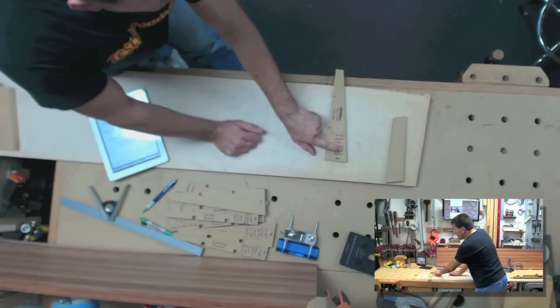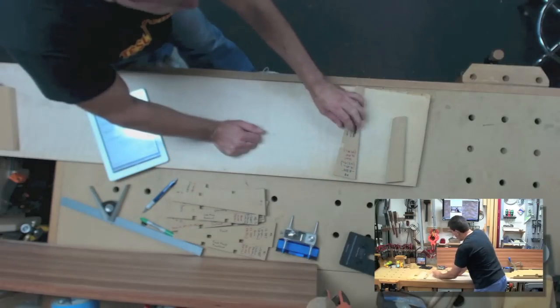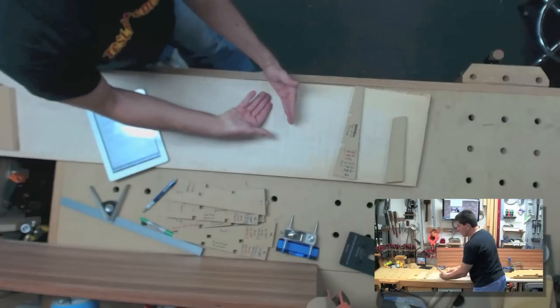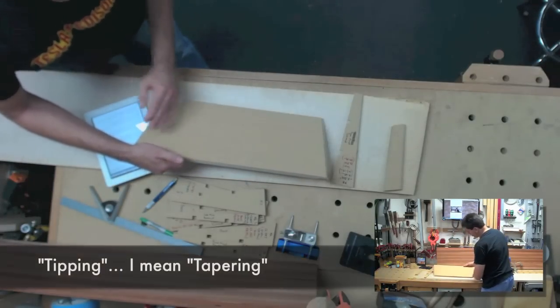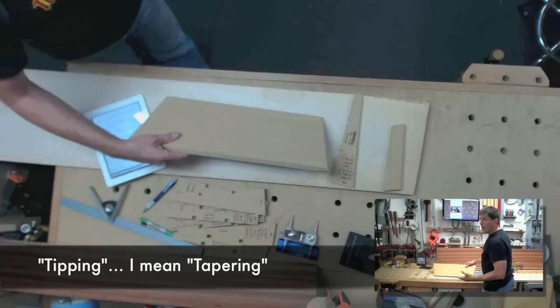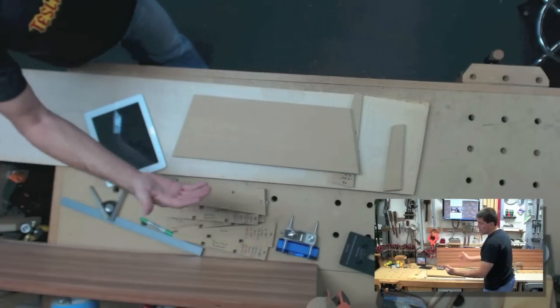I have a really big negative sign on it to make sure I remember that. What it is, all positive angles come into a bore. In my program, at least, a positive angle is one where it's tipping down into the stock. So this is like the normal angle that you would have if you were making, say, a square bowl or a planter or anything like that.